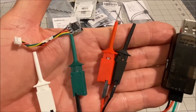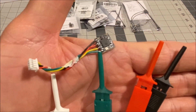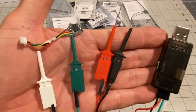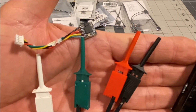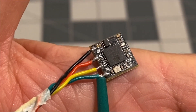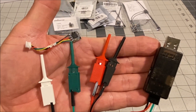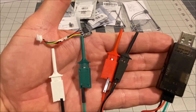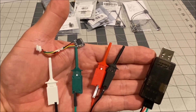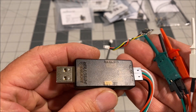Here's something that is just an awesome little gadget — the serial port test hooks. If you already have wires soldered onto the receivers and using the pogo probe isn't your thing, these color-coded spring-loaded hooks grab onto the exposed wire portion of the soldered wires on the receivers. On the other end you connect a single servo wire connector, all color coded. You don't even have to solder or desolder any wires, making it easy to connect the wires to flash the receiver.